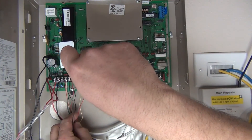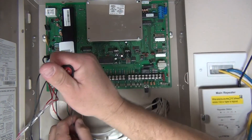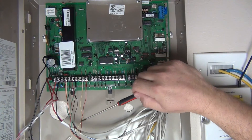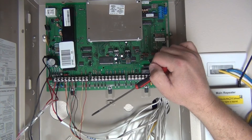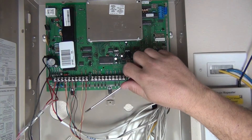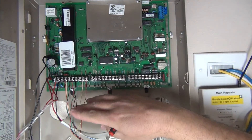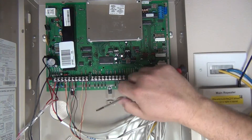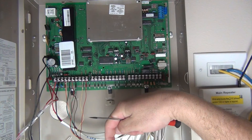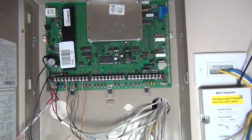The polarity does not matter here, so I'll go ahead and land my red wire. This red wire leaves the panel, goes out to the door contact, and connects to one wire on that contact. The black wire connects to the other side. So the red goes out of my panel, hits the door contact on red, and comes back on black. Here's my black wire now.